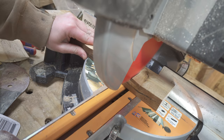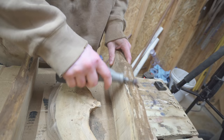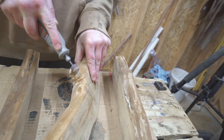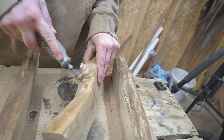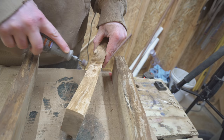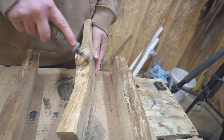The point was to get the ends of each of the boards as flat and even as possible, so that when I laid the sides of the mold against them it would seal tight and I wouldn't have to use a bunch of extra epoxy. After getting them cut to size, I used a Dremel tool and some sandpaper to remove excess bark and residue on the live edges — this ensures good adhesion of the epoxy after I pour the rivers. I also made sure to brush down the live edges after sanding to remove all residue, which helps everything stick together and keeps the pour a lot cleaner.